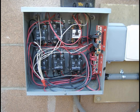Three: the two bus bars are modified ground bars — you can even see they left a few green ground lugs in them. Four: the two bus bars carrying a line of 240 volts fed to the six contactors housed in the box should have been connected with inline cable connectors and wrapped in rubberized tape.